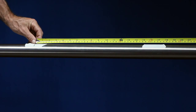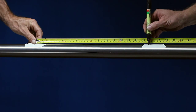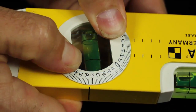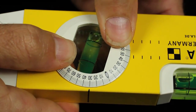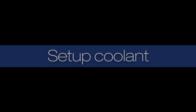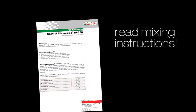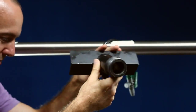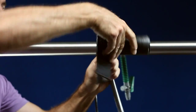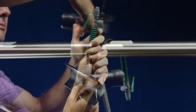The drilling process is a two-person job. Hole centers are nominated in the job specification and must be determined before marking out. Using a tape measure, mark precisely where drilling is to occur. The Mini Pucks will be installed at a specified angle, typically 30 degrees off vertical, pointing down and inwards towards the area or path to be illuminated. Mix the coolant, pour it into the plastic bottle, screw the coolant drain hose into the outlet hole of the drill jig, put the other end in the bucket, then attach the coolant nozzle to the delivery spigot.